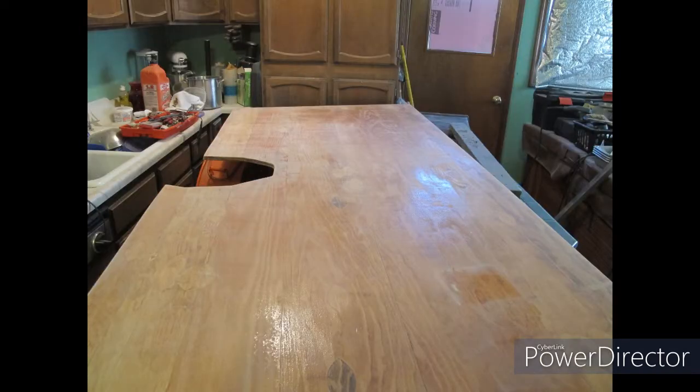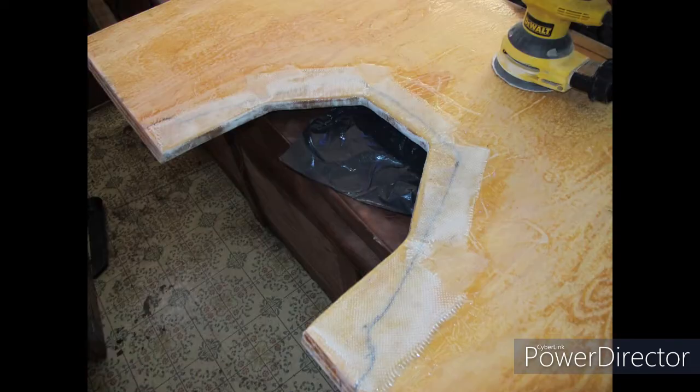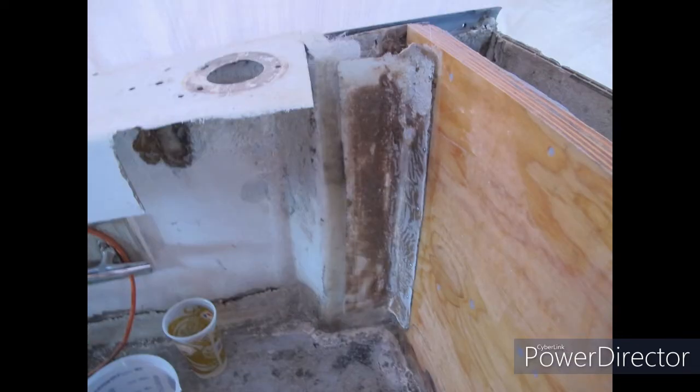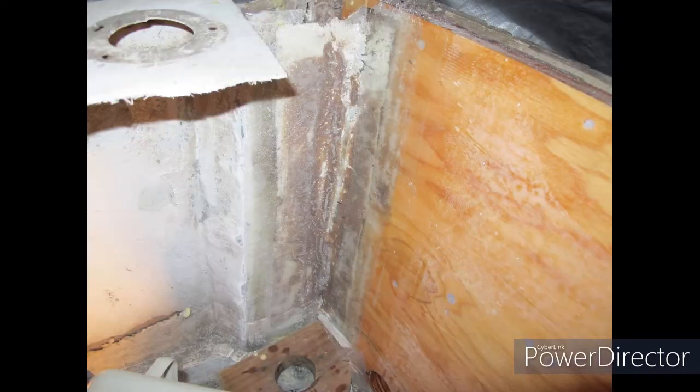I made a template, cut it out around for the transom plate, and then cut it to fit after putting some fiberglass on the edges. That's the part that's going to be exposed. Here you can see I've got it attached in where it goes — it fits in with the tabbing. You can see the plywood is epoxied in with the tabbing that remained there that I cut around.